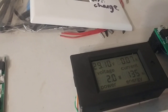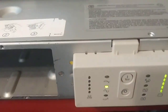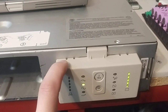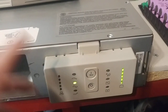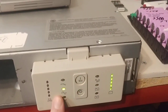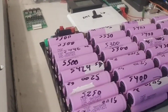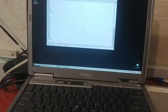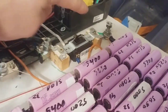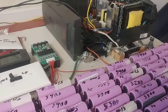For some reason it won't charge up to 29.4; it just goes up to about 29.13. I can't see any difference if I set the APC to 29.43 or 29.29 — those are the only two options. If I put it to that, it just reads errors and refuses to charge up the batteries. Not sure what's going on there. The big error problem I have is I should have had a breaker on the positive terminal — I didn't do that, so I'm going to have to do that in the very near future to try and resolve that issue.